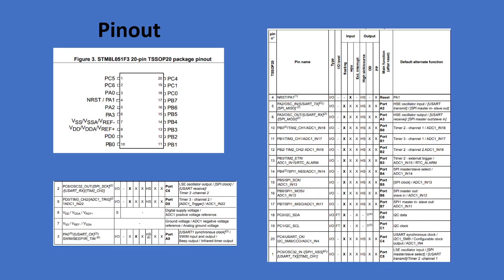So the most important, besides the fundamentals of what that chip or component does, is the pinout. In hardware hacking, you're going to take devices like a Bus Pirate, connect it to very specific pins, and then get it to print out using a Linux terminal. You can give it a command and it will feed out certain information, like your flash ROM dumping everything that's on it. But you have to know the pinouts you need to connect the probes to, because if you do it wrong, it's not going to give you what you want.